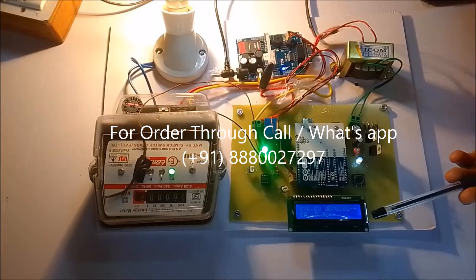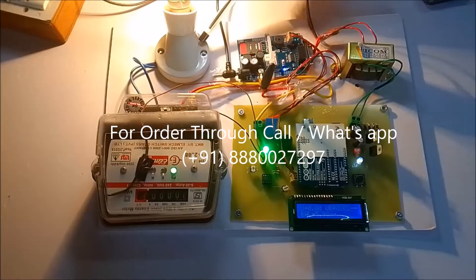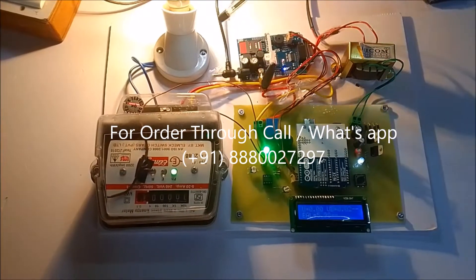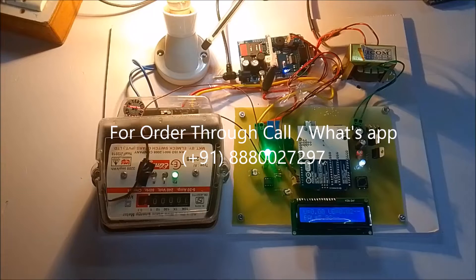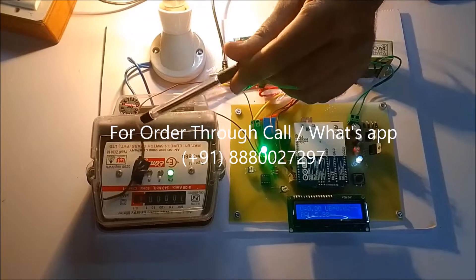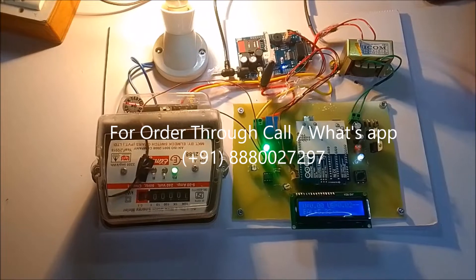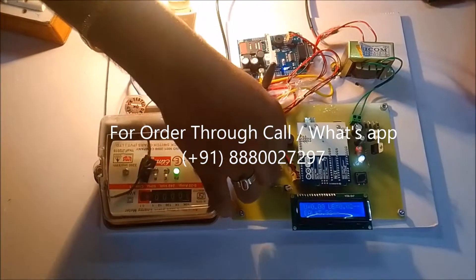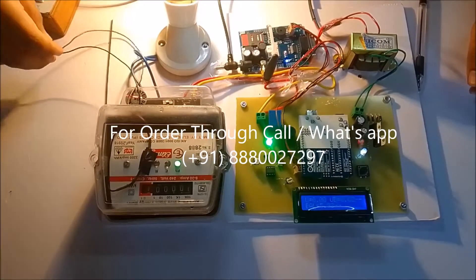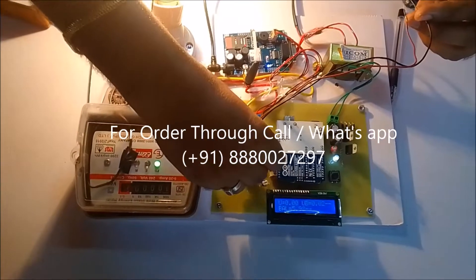That interval of 5 or 6 seconds depends on the wattage of the bulb. We can now see 0.02 used and 5.98 remaining. If we insert a 60-watt bulb, the pulse would come after 18 seconds. If we use 1000 watts or more, the pulse interval becomes very small — after one or two seconds. For demonstration, I will now remove the connector of the LDR and insert another LDR.